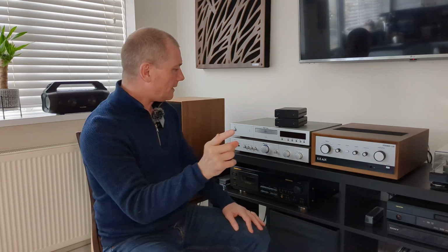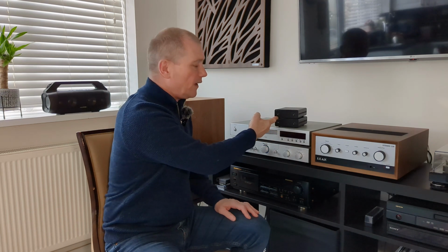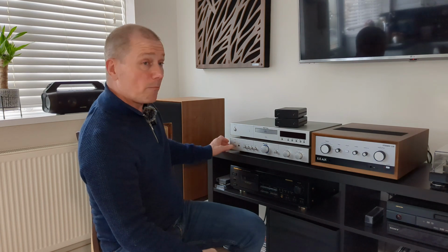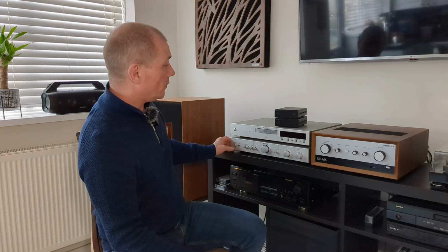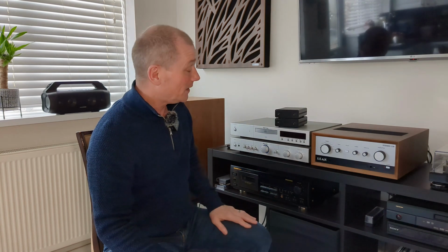One thing I will say though, which I forgot to mention earlier, is that I had to turn my amp on first, then the V3 monos. Otherwise, if the V3 monos were on auto or on when I turned on my amp, there was a big thump come through the speakers, quite loud. And also the same when you turn it off. I didn't like that. But what I found was, if I turned my amp on first and then turned on the Fosi Audio V3 monos, it was okay. But the problem is that kind of defeats the object of the auto, doesn't it? Anyway, it might just be this amp. I don't know if it does it with every preamp. But there we are. Just thought it's best to let you know.